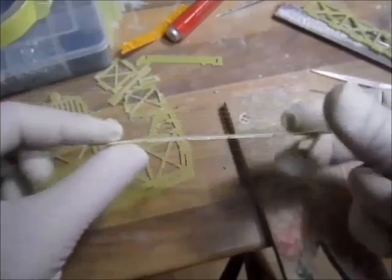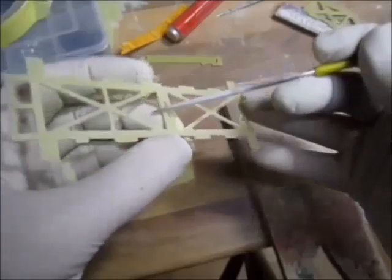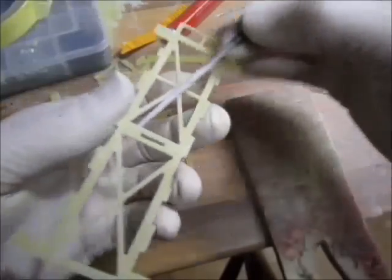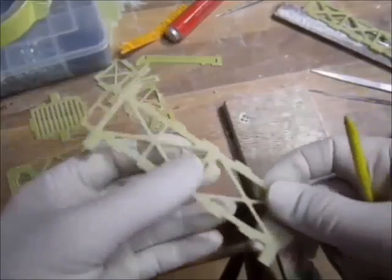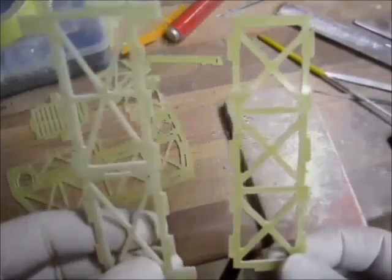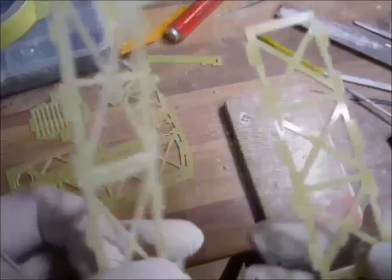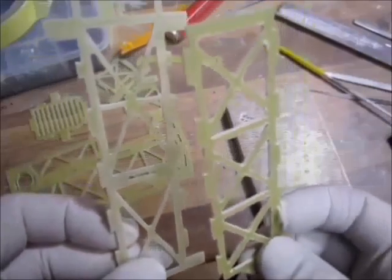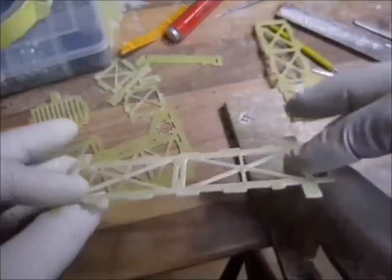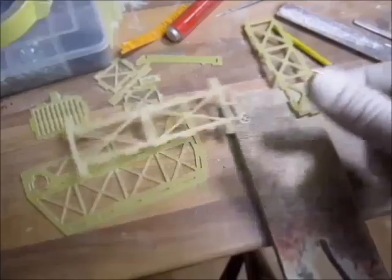So basically, whenever I finish the sanding, there's still some sharp edges left, so I'm using the file at 45 degrees roughly, everything all around, and that's what it's gonna look like unfinished. You see the difference there. So that's my CNC. People, don't get confused. I don't own a CNC or 3D printer.